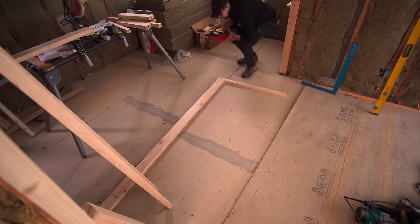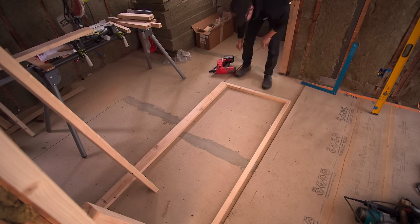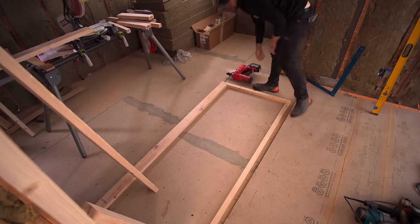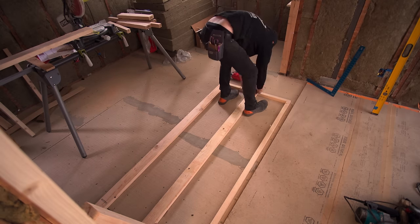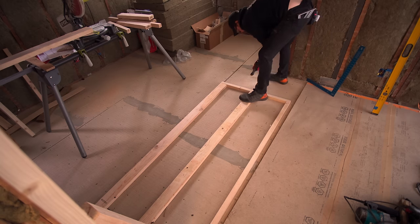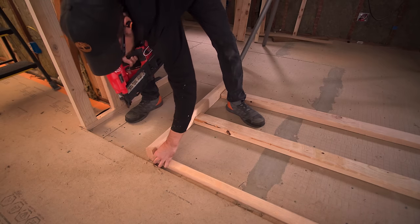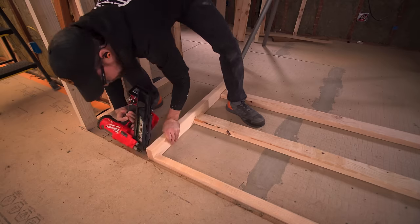This wall is going to be framed out the same as the wall that I just put in the kitchen, except for a couple key differences. I want it to be a little bit shorter than the full height because I can actually gain a little bit of space on the linen closet side. I'm also going to tip up the top 2x4, and this is going to give me some nailing surface to pick up the archway detail I'm going to add to this built-in.